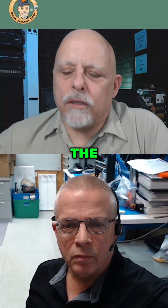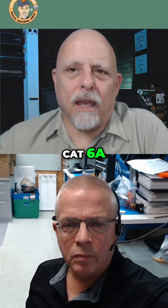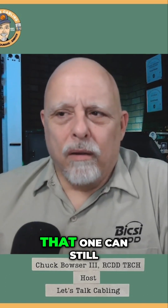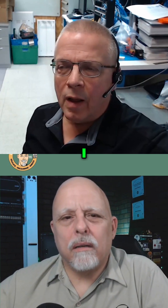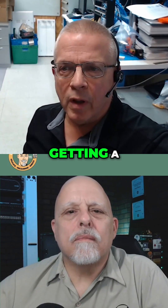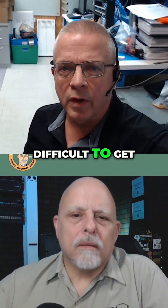With the one with the circuit board inside of it, it's rated to Cat 6A. But we both know they can both be rated Cat 6A and one can still be better than the other. Which would be better? I think you're going to have a very difficult time getting a crimp-on Cat 6A that will pass Cat 6A. You might get it once in a while, but it's really difficult to get.